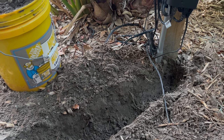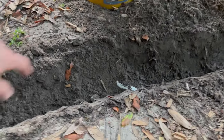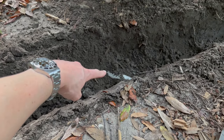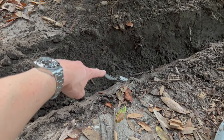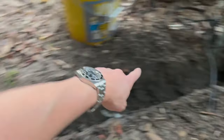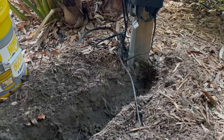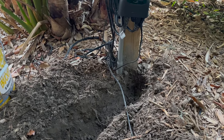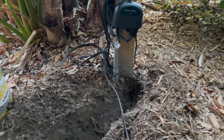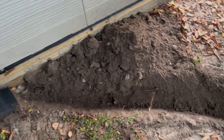I'm doing this myself so I'm going to bend the rules a little bit — I'm probably only going to be about eight inches deep. I have these irrigation lines here, three big ones, and I'd rather not go under them. It's such a short run. But if you're staying up to code, you're going to want to bury it at least 18 inches deep for schedule 40 PVC.